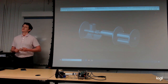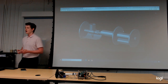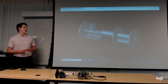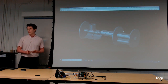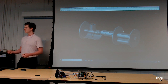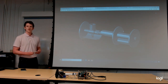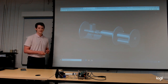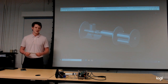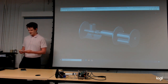We chose the 3D printing because, though our components aren't necessarily the most complex ones, we needed construction that was quickly repeatable, as our designs were changing all the time, and 3D printing afforded us that changeability. The material we chose for these prints was a nylon carbon fiber, and we chose this over PLA or ABS because it is far stronger than either of those and just as light, meaning that the payload can be lightweight while having its components be strong enough to perform the required functions.